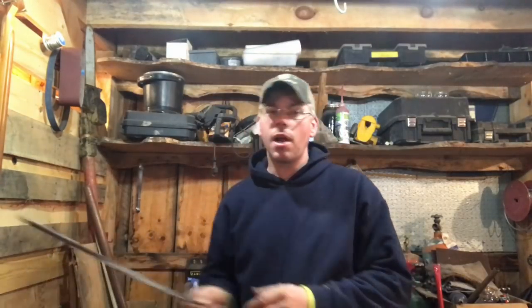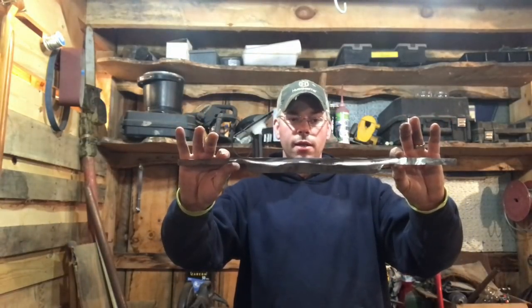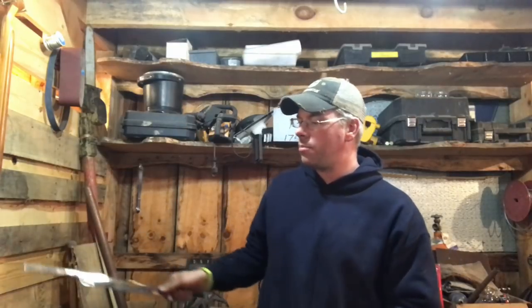The reason we're doing this is I have the start of our draw knife here, another one for a mystery recipient who will remain nameless until the last video. Tonight I'm going to show you how to turn cat litter into water glass. If you don't know what water glass is, it's like a high-temperature glue you can use to make refractory. We've got perlite, sand, and sodium hydroxide — 100% lye — which is generally used to clear drains.